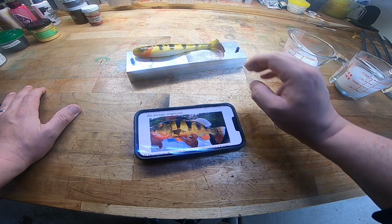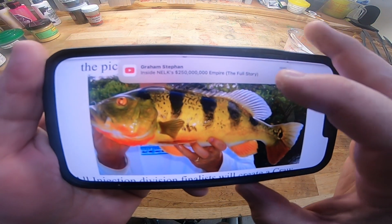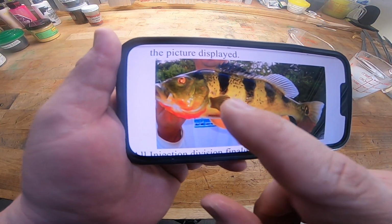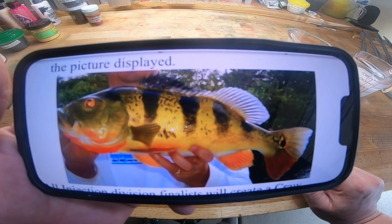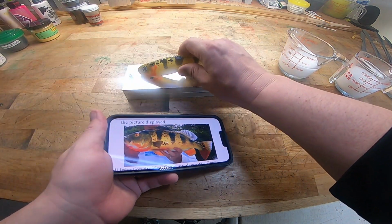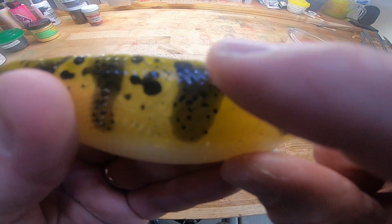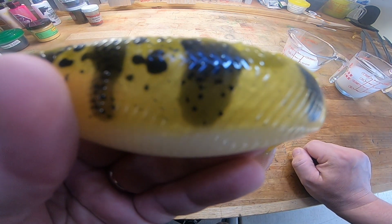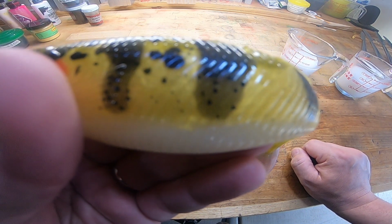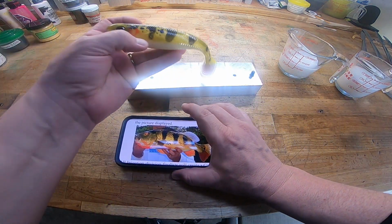I think how I wanna start is I'm gonna start on the stripes again. Got some very cool stripes on these, and I'm gonna try and emulate it the best way I can. And the only way that I thought of for this, that you can see here, is I went really dark black, and then I let it pull up here, and then I let it kind of slide down a little bit and thin out with some 0.035 flake in there. And that really is kind of what I saw in there.